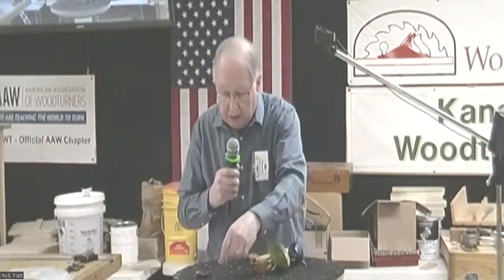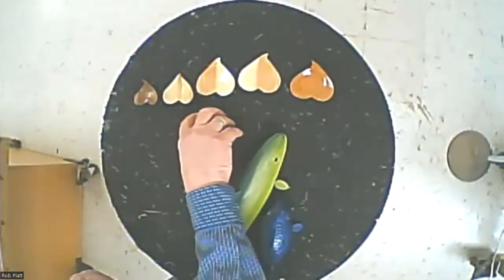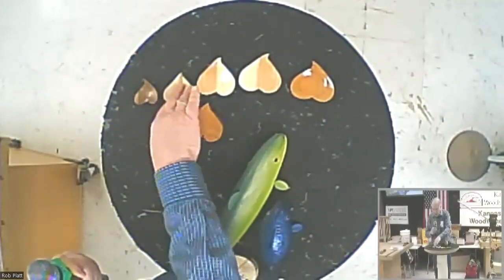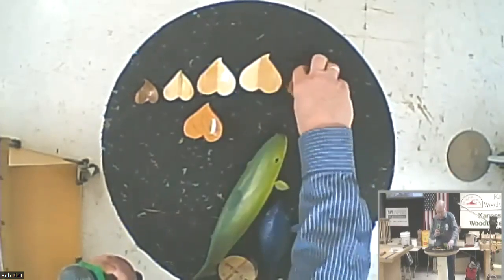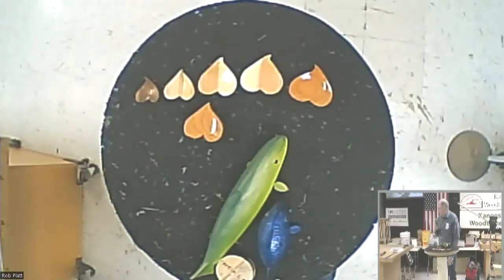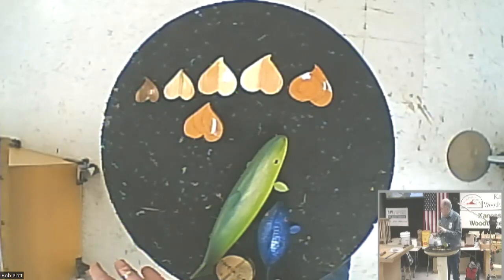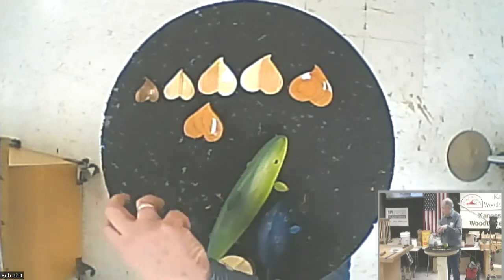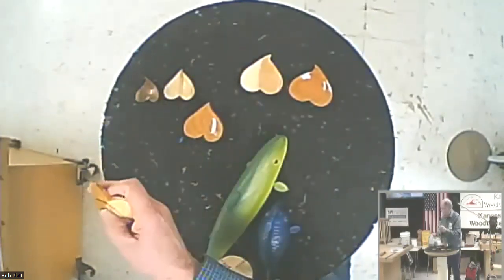Tomorrow is Valentine's Day, so I made Valentines for the ladies in the family. I made them out of cherry, some quarter-sawn ash, some oak, and the black heart out of walnut. I turned them between centers first to get them round, then cut out a paper pattern of a heart and cut that out on the bandsaw. Then I made a tenon and chucked it on there — I have some spigot jaws that can chuck on a small tenon. I cut them all and then used a jam chuck to cut the back side.